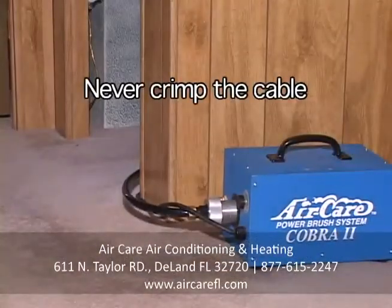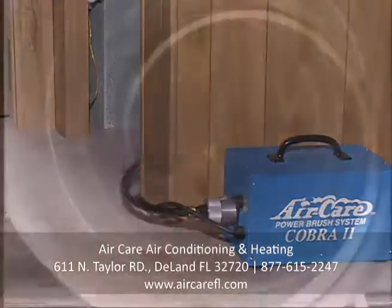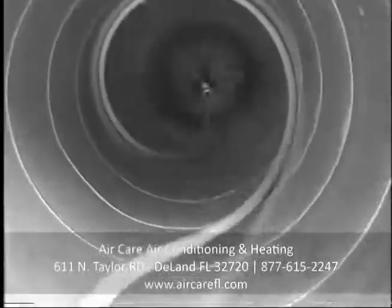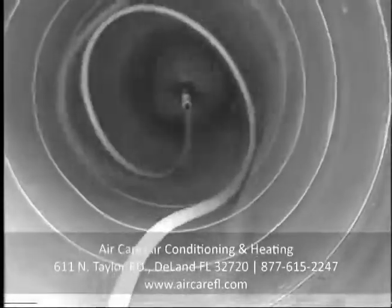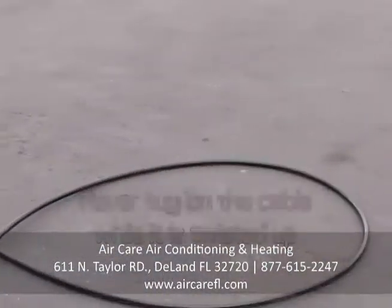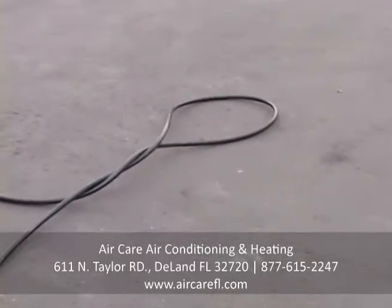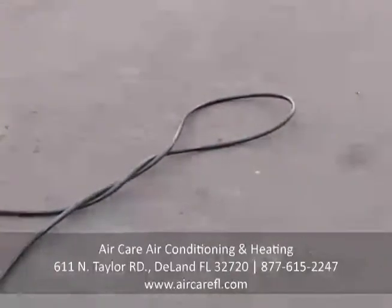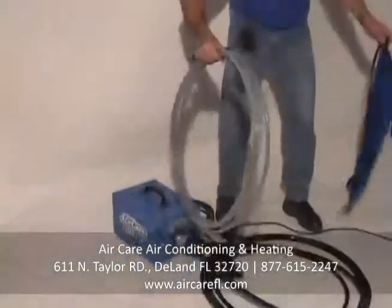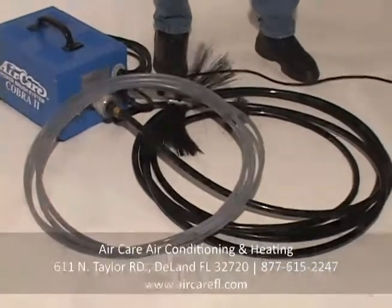Never crimp the cable. Be especially careful to not pull it around sharp corners and to not run it so fast in a large duct that the cable twists up. If it does twist up, turn off the motor to allow it to unwind. Never tug on the cable while twisted up. It will cause a crimp in the steel strands and may lead to fatigue and premature breakage. Store the cable in a 24-inch loop or larger to prevent a crimp.